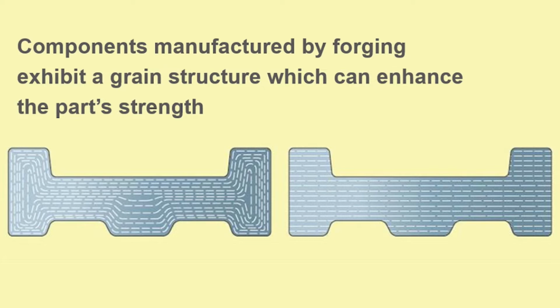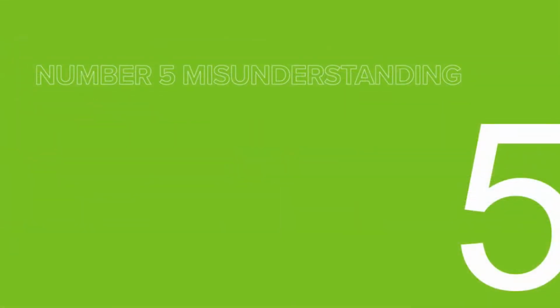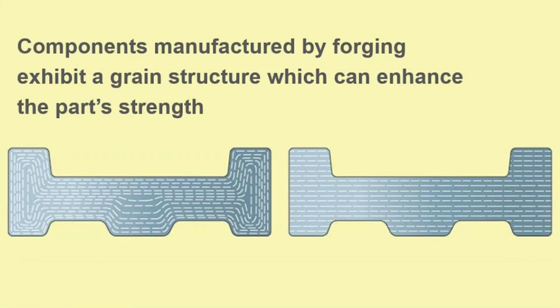It will actually change the way that you view the material itself. So you can have parts that are the same shape and form, but they could even be made of a different material, and they're not going to have the same test method. This is because varied materials have different permeability and retentivity.